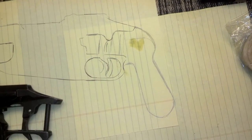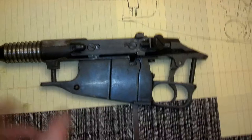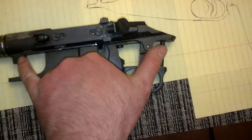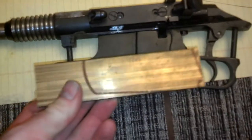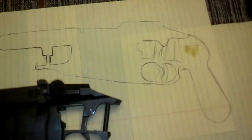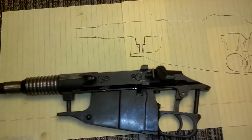Probably going to replace the standard Mosin trigger with a Timney, and I might do that pretty soon so that I can design the grip around it. I'm going to cast a block here to fill in this little segment. I don't know if I'm going to do any sort of a nose cone piece or what. And then cast this back part, take the brass plate, lay it across, rivet it through to both sides — and then we'll have a nice brass frame pistol grip Obrez with C96 grips and a scope. It should come out pretty neat.